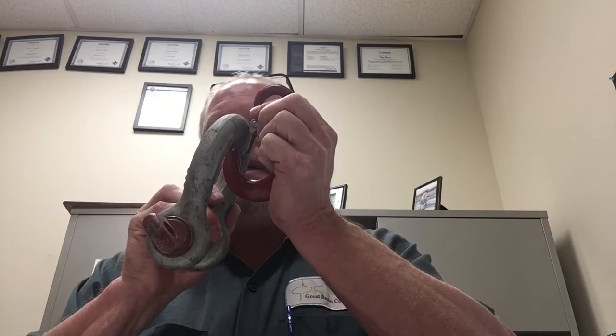Figures two and three show where to load the hook. If a sling doesn't fit over the hook properly and only contacts the point, that's called point loading - it will pull out and damage and open the hook. We want the load down in the saddle, directly below the lifting line. We also have to make sure we have the proper size eyes on the slings so they fit correctly - a big shackle that's too large can't be used with a smaller hook. Hooks are used everywhere so make sure you understand this section.